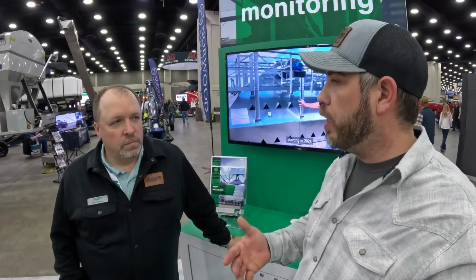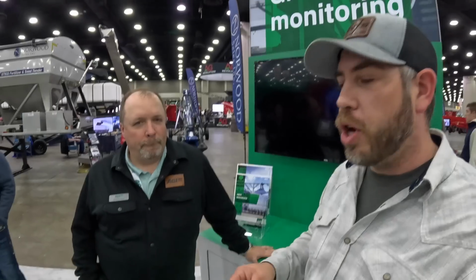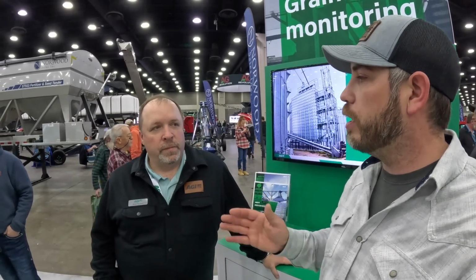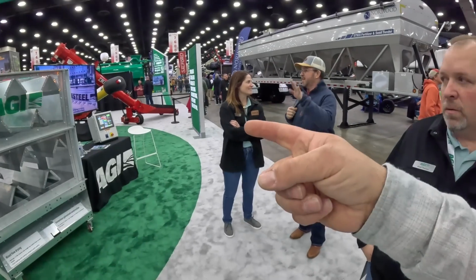Okay, let's touch base on the moisture sensing part of it, stuff like that. You guys kind of had enough already. You understand the mix flow, right? You know how it all works and everything, so we're not going to bore you with that. Let's just find some of the finer points on the drying technology side of it, because that's what kind of sets all these dryers apart a little bit, isn't it? Don't you agree? Maybe on the management side of the drying. So you guys have something over there.